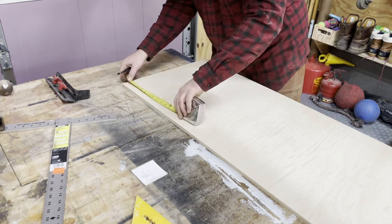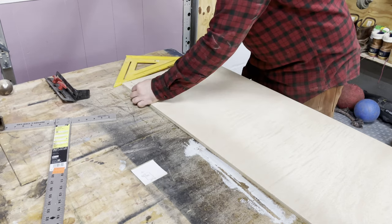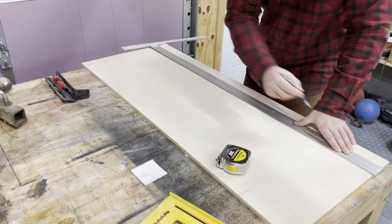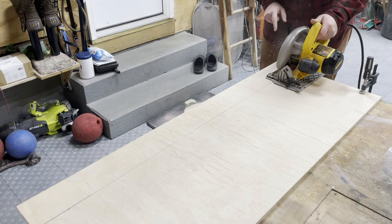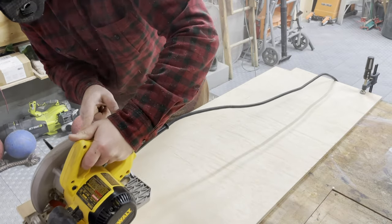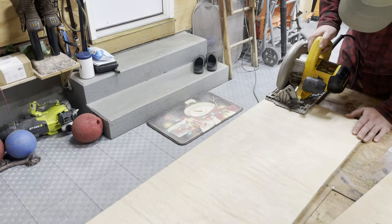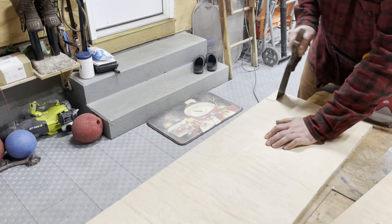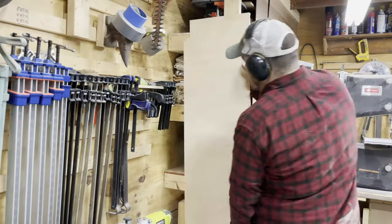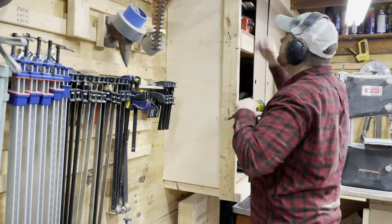Now I'm cutting the left side, which is part of the shelf that's exposed. I start out by doing a little notch cut and then measuring my lengths and striking that line. It's not exactly square so I just cut this one by eye following that line. I'm cutting out that notch that fits around a 2x4 in the recess. You can see how that piece gets installed — pretty tight friction fit, which is what I wanted — and I secure it with a few screws.